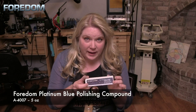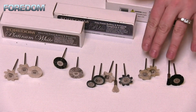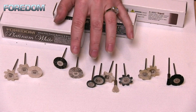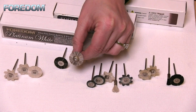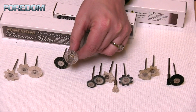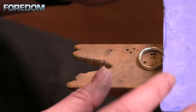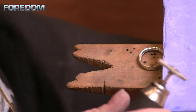Everything has gone through the ultrasonic and I used a soft, mild dish detergent to make sure everything from the Tripoli step was removed. Now we are going to move into a platinum blue, which is a pre-polish. This is going to be a little bit abrasive, but not nearly as abrasive as the Tripoli was. Some people may find they don't even go to this stage, but in this video I'm going to show you the Tripoli, the platinum blue, and then the platinum white. The platinum blue compound has a much softer feel to it with a much finer abrasive. The same precautions still apply — you still need your mask and your glasses.